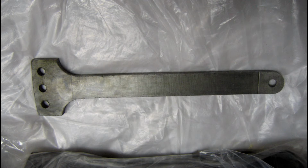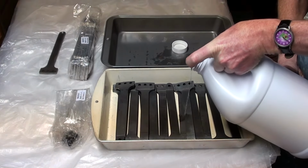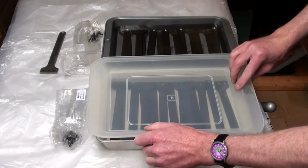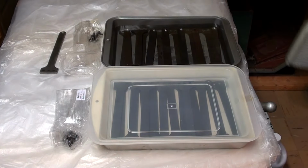The first step is to deburr and remove the mill scale on all spokes and the wheel rims. There are many methods to remove the mill scale. It is important to do so before painting parts. If this step is omitted, over time, the scale will separate from the surface of the part, causing hours of careful painting to fail. The method we chose was to use cleaning vinegar.